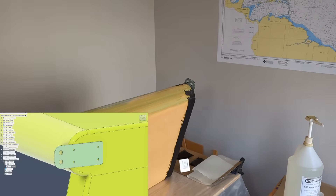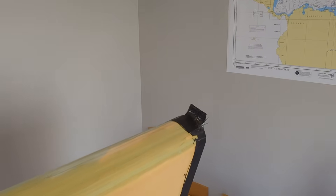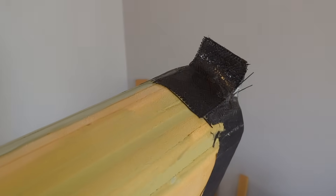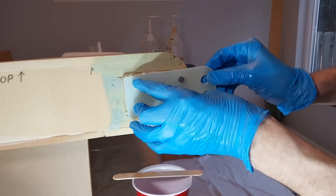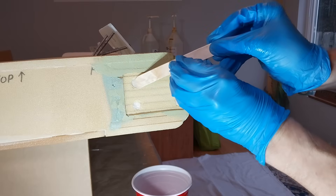Earlier I added four more pieces of carbon fiber to each side of the pad eyes I made on the buoyancy arch — this is for the attachment of the main sheet. I'm really excited about these pad eyes; they're super strong. They've got a G10 plate inside that I fabricated, held in with four bolts, and the bolts don't just go into the PVC foam — they go into a 3/8-inch hole that I drilled and filled with thickened epoxy. One square inch of this PVC structural foam has a compressive strength of 90 pounds, so with four bolts on each side you've probably got about 360 pounds of holding power, not even including the epoxy on the side of that G10 plate.